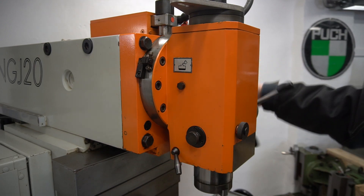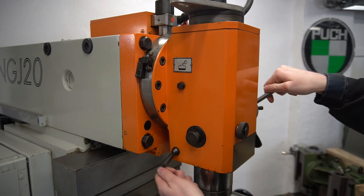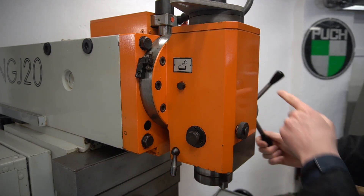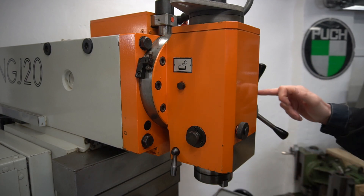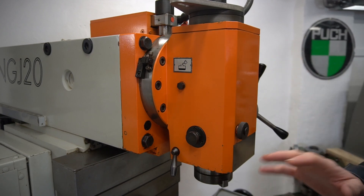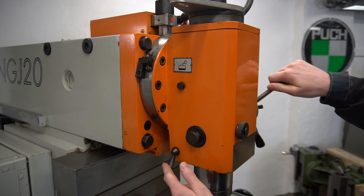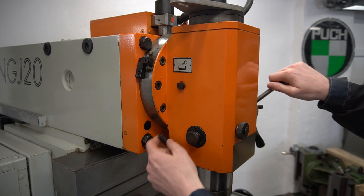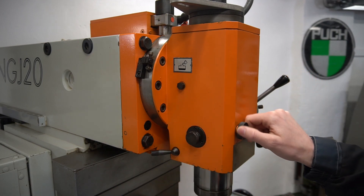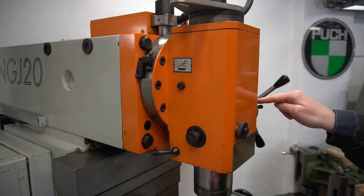This handle is the quill lock and it's used if you are extending the quill — you can lock it and then it won't move. But as the handle is spring loaded, if you remove the quill the handle will unwind the spring, then it will just rotate until all the energy in the spring is out. So what you want to do is be sure the lock is loose, then tighten this knob. This knob will fix the handle itself, not the quill but the handle.